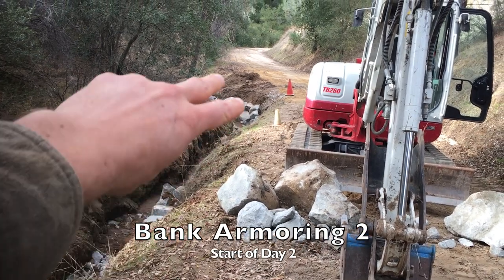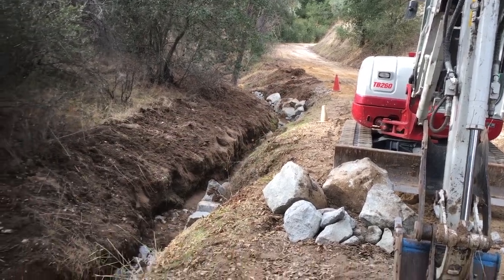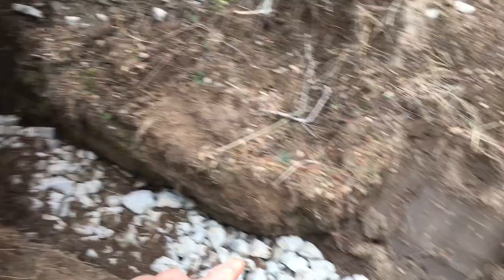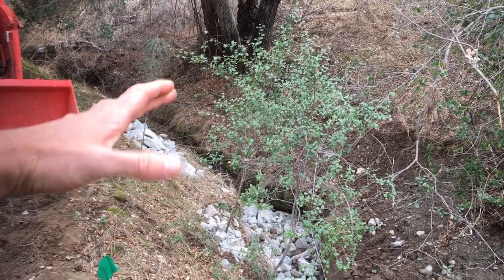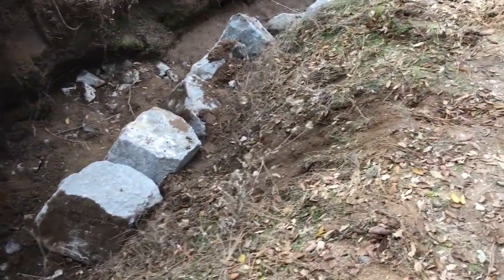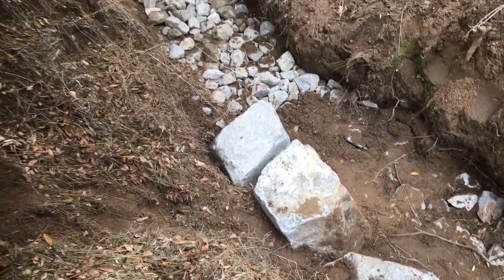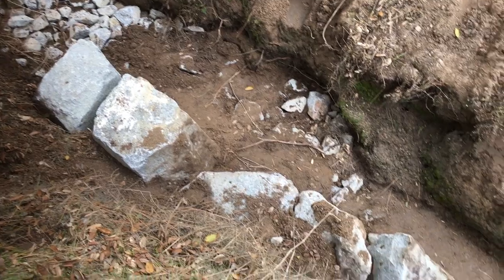Here we are looking up where headcuts four and five once were. Now we have a series of step pools coming down and we've begun the bank armoring project. We started by laying two courses of gabion rock all the way up and knitting it together along the bottom. We'll end just around this corner with a nice little dissipation stone weir, bringing it down to a level sill with a few grade control structures set in the bottom. Now the current project is to start armoring this side of the road — dropping in large rocks one at a time with the excavator, setting them in and wedging them by tapping with the bucket. We'll do at least two courses of large rock, possibly three in some places.